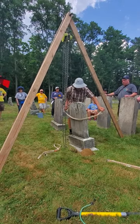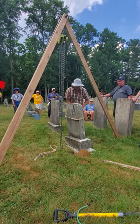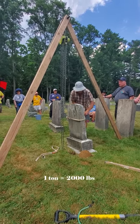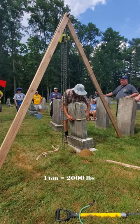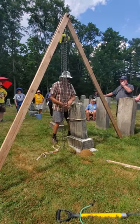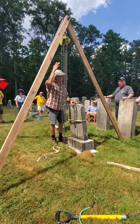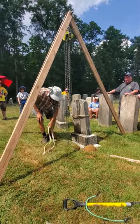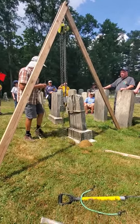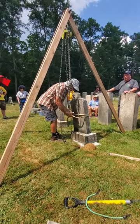Slings are very reasonable — I don't know the exact price, but they're not that expensive considering the work they do. These slings are rated to about 2,000 pounds per sling, so the way we're lifting you could theoretically lift almost two tons. However, this setup uses a one-ton hoist, and with my design tripod I wouldn't recommend lifting over about 1,000 pounds safely, though I've done 1,500 which is pushing it.